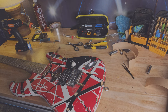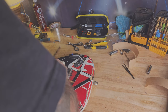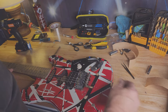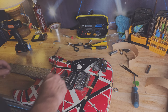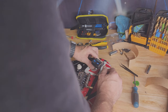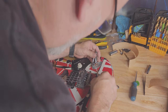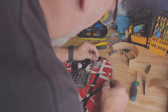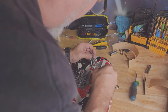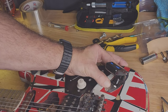And it does work. If you guys want to hear it real quick, it's not tuned up, but you can hear it plugged in. See that? So what's happening? Something's grounding out on the inside. Yeah, what they did is they soldered these way too close together. So I might have to re-solder this. But here, cut out. Watch.